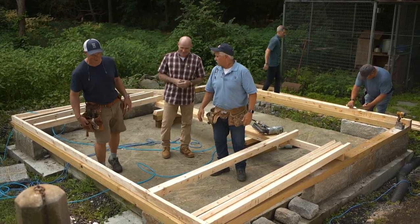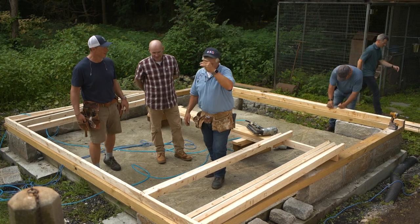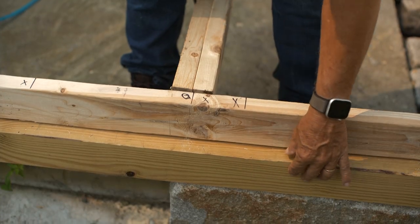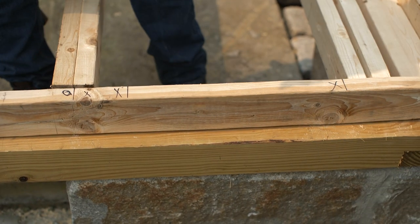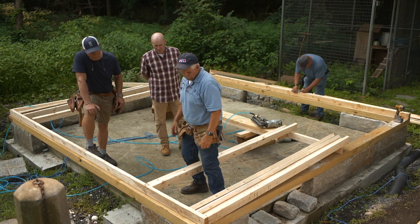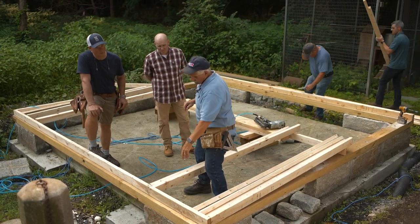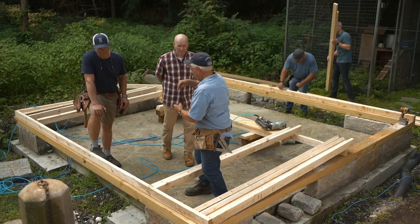All right, and Tommy, it looks like you've already got a jump on it. We have a jump on it. On top of Mark's granite, we placed a pressure-treated sill, four-by-six, half-lap the corners. Code says that you have to have pressure-treated wood on top of masonry, and that we have. Here's a mechanical fastener that's drilled through the PT and then into the masonry, and when he tightens it, it locks itself right down. So you don't have to worry about lift or slide.